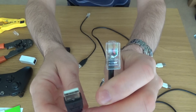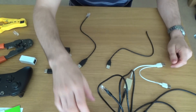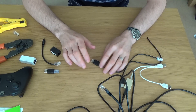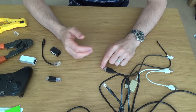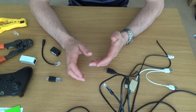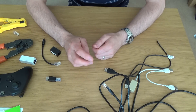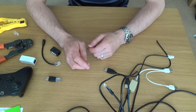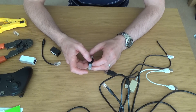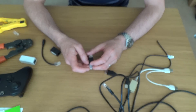They all use the same wiring guide. It doesn't really matter what wires you use in the RJ45, but I would always push the two data wires down a twisted pair. In your RJ45 you've got your blue pair, orange pair, green pair, and brown pair — four pairs. I would push the data either down the oranges (pins one and two), the greens (three and six), the blues (pins four and five), or the browns (seven and eight).